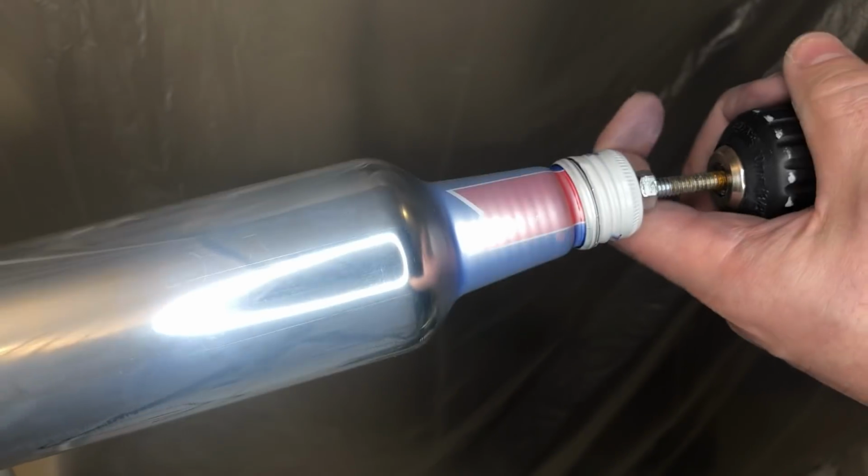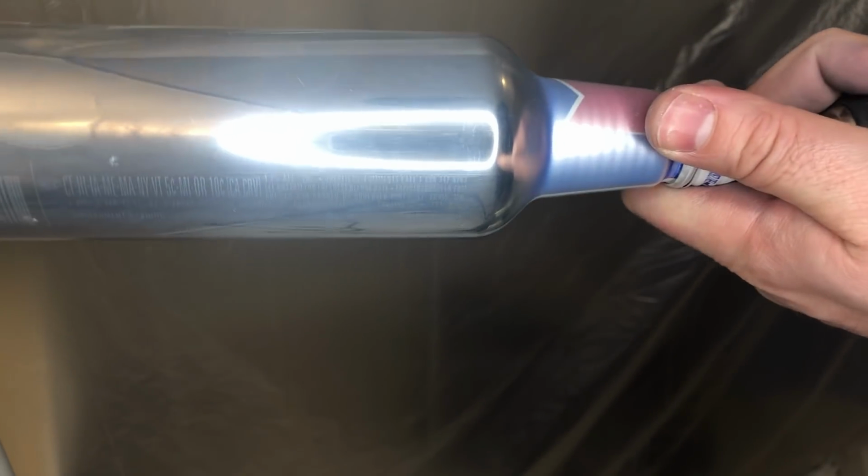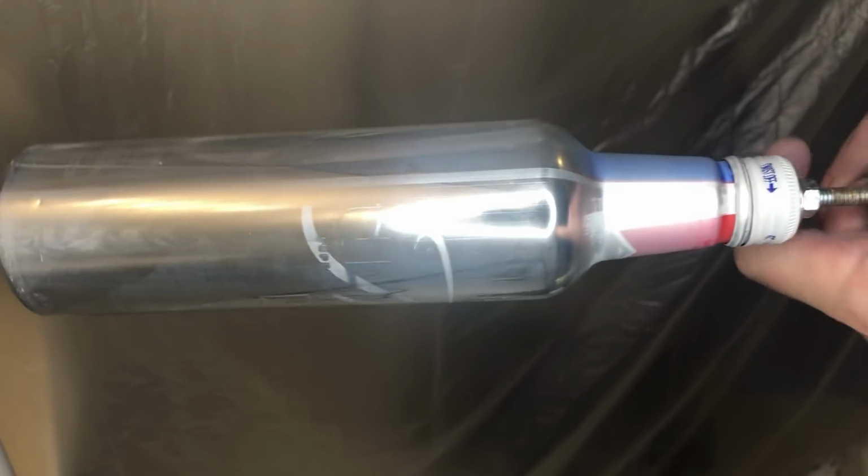So once you've got this can jimmy-rigged to your Dremel or your drill, you'll want to have some sandpaper in hand to give it that nice brushed look. If you either didn't have a pressure cooker or you have the leftover residual graphic on there, just start with a 60 grit because it'll go so much faster than if you just do a 220 grit. Start with a 60 grit till you can't see any more of the graphics, and then move on to 220 to give it that final look.